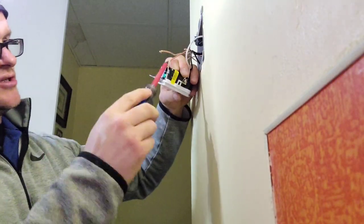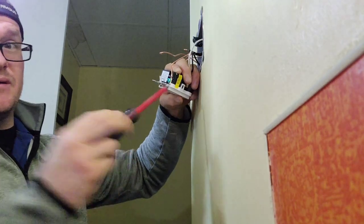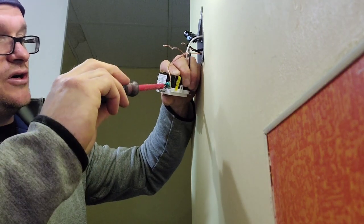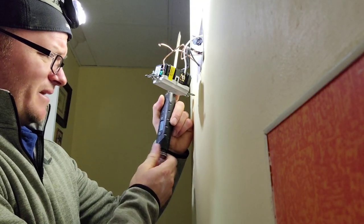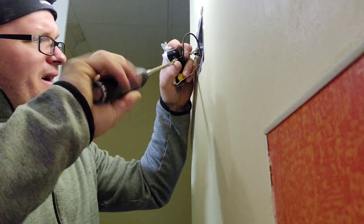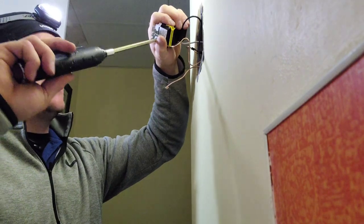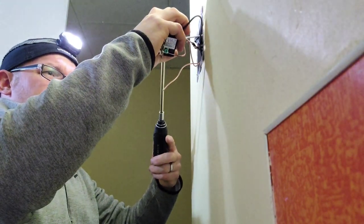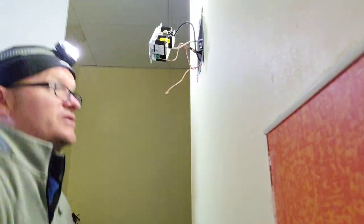Same thing on the ground — just slide it into the bottom. I want to see the copper, make sure it's not poking out the back, and make sure it's good. Then I get my torque screwdriver, set it to the torque spec, and that's going to tell me this thing is perfectly tight. I turn the device around and always count — I have three connections on this one, so I count to know when I'm done. One, two, three. That is done.